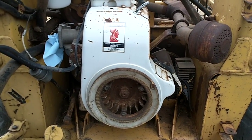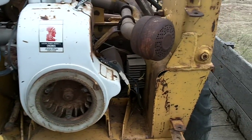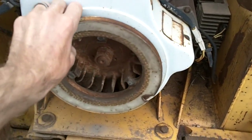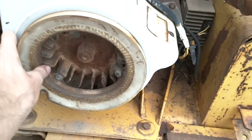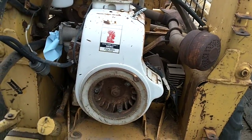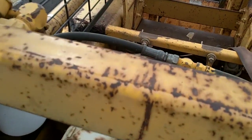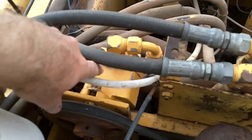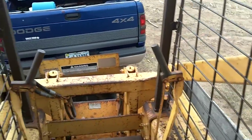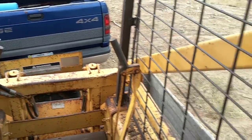It rolls over and it's free. I might spray some starting fluid in it and see if it'll fire, but it feels pretty tired, so I suspect it's just plain worn out. I'd like to put a 22 or 24 horsepower V-twin in there, and then I can upgrade this hydraulic pump to something bigger and put auxiliary hydraulics on the bucket for a grapple, post hole digger, or whatever else I get a wild hair and build.